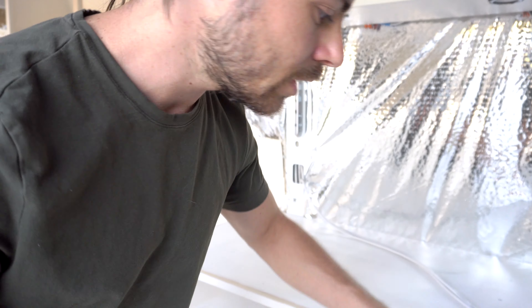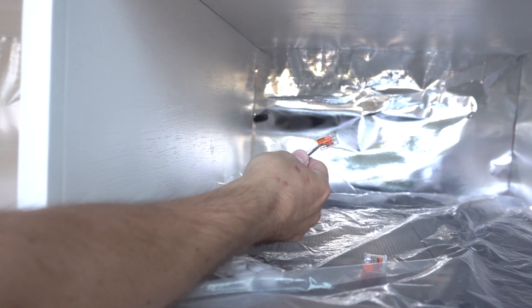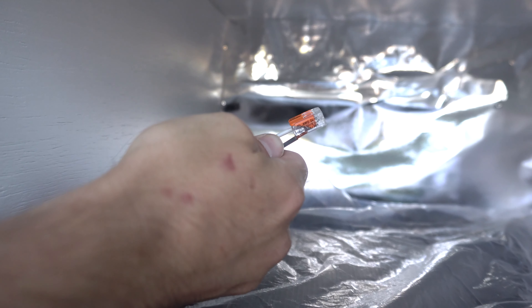The other type of wiring is solid copper, and there are different gauges. There are a lot of calculators online, and if you go to Home Depot there's a chart when picking out wiring — you'll want to find the appropriate gauge thickness based on how many watts that appliance is actually going to use. For the fridge, I went with solid gauge wiring — this is 14 gauge, which is basically what you find in any home appliance.